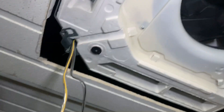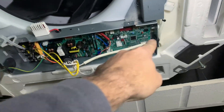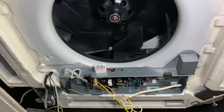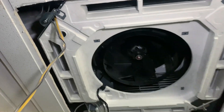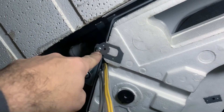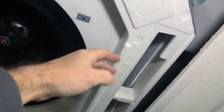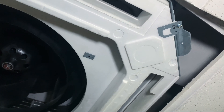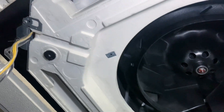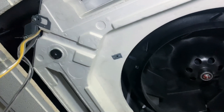Once you've done that, you're going to want to get these screws out around this plastic section — there's a couple on that electrical box as well — and then we're just going to pull this plastic section down. In each corner you'll see a metal tab with a screw that's basically holding all this polystyrene tray, so we're going to undo all of them, then pull down on the tray to get it out, and that should expose our lift pump and float switch in this corner.